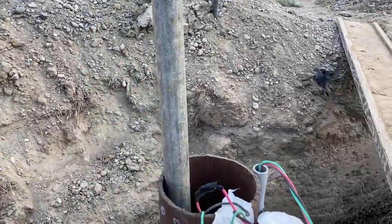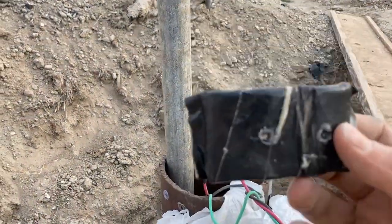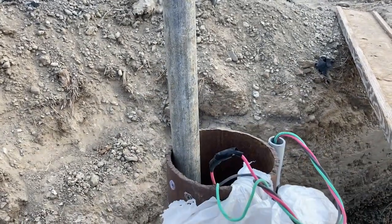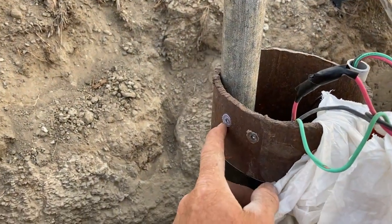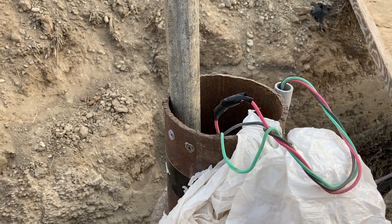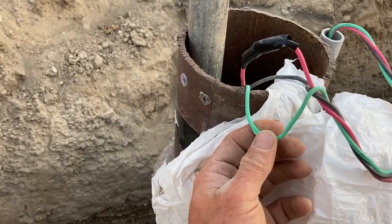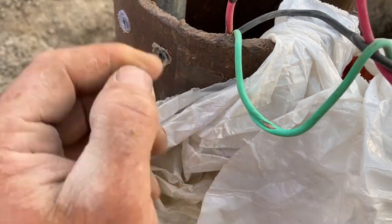What I found — and I want to show you this — is I wanted to put a clamp of some sort in the well head. I took this piece of steel, it's actually a mending plate for greenhouses that I design and build for people. I wrapped that with quite a bit of duct tape and used some self-driving screws to hold it in place. I thought it was a good idea so the wire over time wouldn't sag in there. But when I cinched it down, even with that duct tape for stress relief, I went ahead and severed the insulation on all three of my lines.